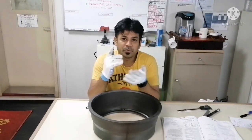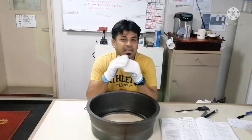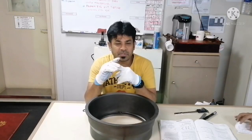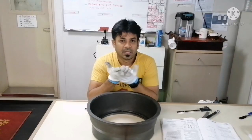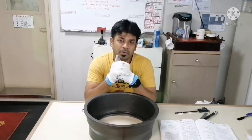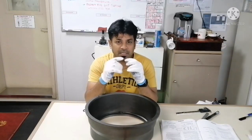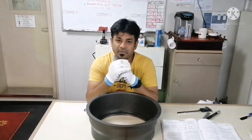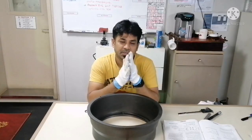Whenever we do the piston overhaul, we have to take piston ring clearances. This is to ensure your piston rings are within the limit and the wear is not out of range. There is a recommended value from the maker, so you have to follow the maker's recommended range. If it is exceeding, you have to go for a new piston ring. If it is within the range, you can use it back.